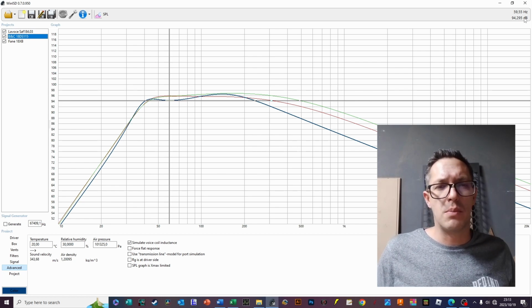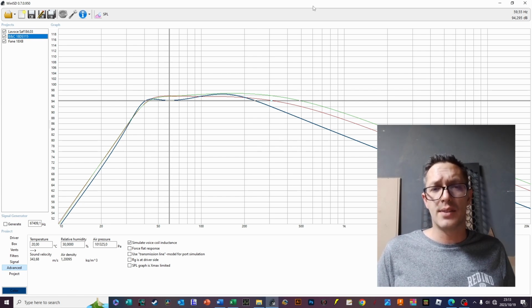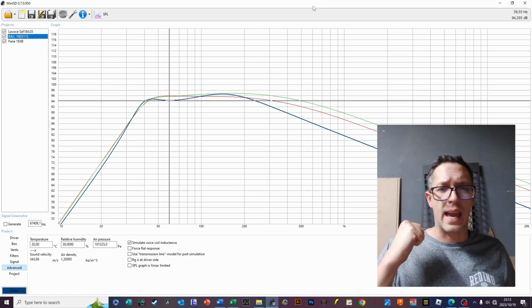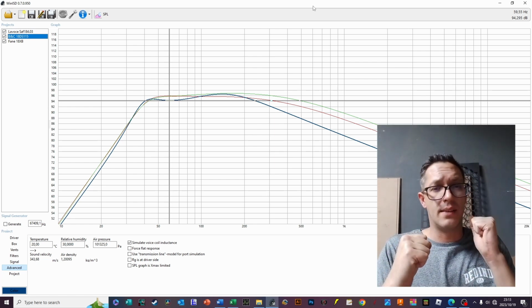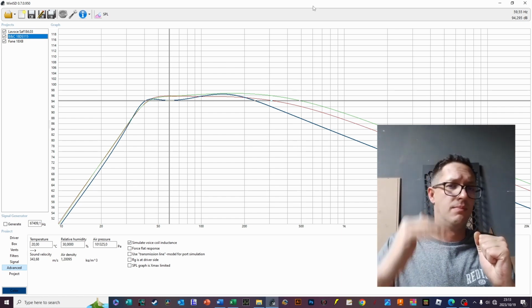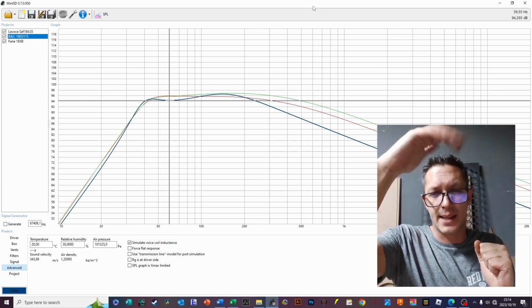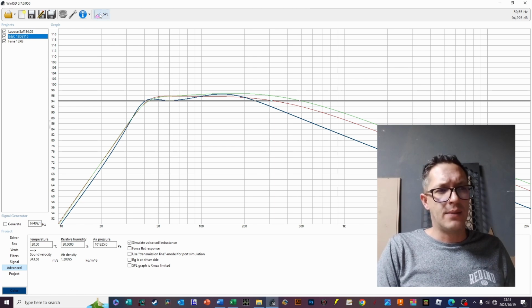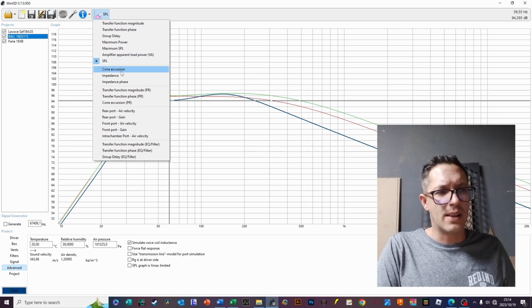So going back to the blog post, we realized very, very quickly that we could calculate how loud something can potentially be if we know the sensitivity and we know the actual power handling of the driver. We can use the 10 log formula to calculate, based on how many watts we have and how loud we were as our reference, how loud we can get based on our potential power handling. Very easy to understand using the 10 log formula, right? Now, you don't need to know that maths because, again, there are free calculators. You can use a free calculator to do this.